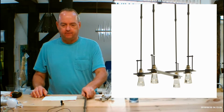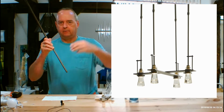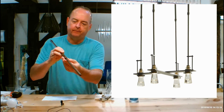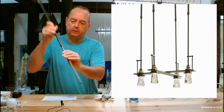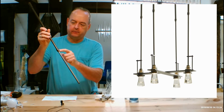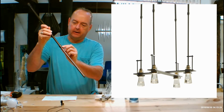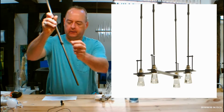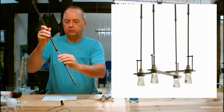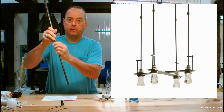So you actually have 4 of these lights that are going to be hanging on 2 different planes, and 4 of these telescoping rods. If you're familiar with Hubbardton Forge, they have a patent on this telescoping rod idea, in which this pipe telescopes into this pipe. This is a clutch. There's a little plastic friction sleeve hiding in the middle of this, and there's a hex nut hiding right there that you can barely see. You use a hex wrench that comes with it to tighten that little screw against that friction sleeve, and it will stop you from going up and down.